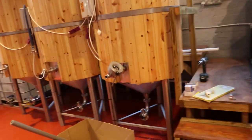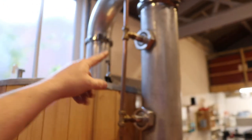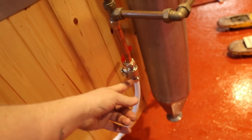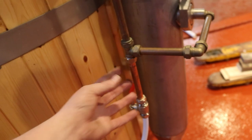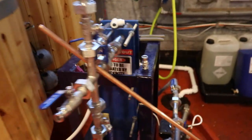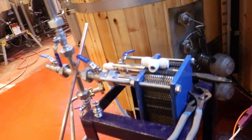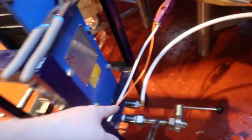I've installed that drain pipe and I've also teed off where we had a connection and a tap for the condenser flue that supplied water to the sprayers via a hose pipe. I've hard-plumbed this time — it's got a push-fit connector so we can disconnect and pull away if necessary. All of these taps are isolated up on the wall with that little ISO valve, and the tee comes across under the boil kettle and into the plate chiller. So now instead of having to unhook my hose pipe and plug it into the plate chiller when cooling, I've managed to get that wired directly into the mains.